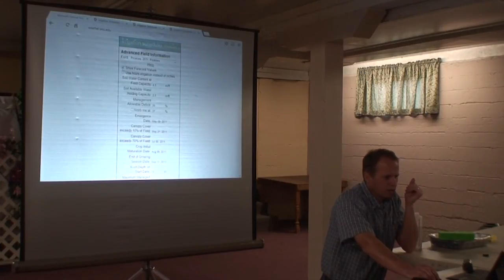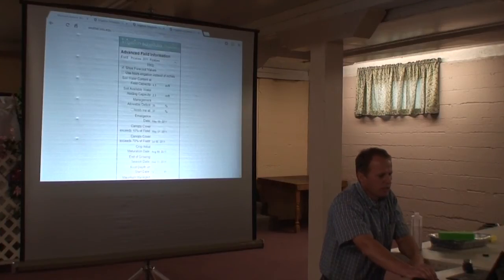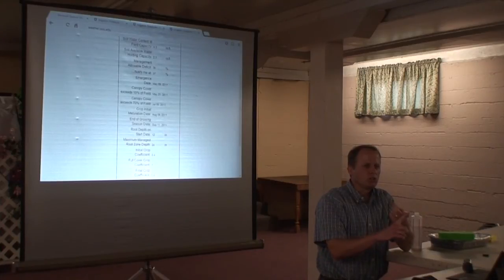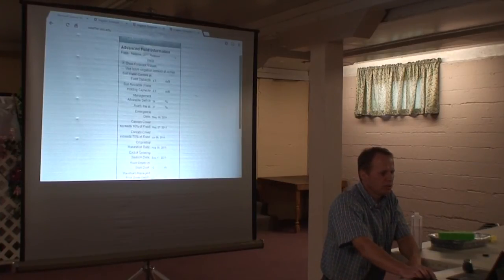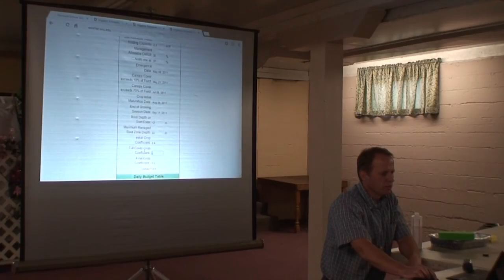I'm in a different field now, and right now it's using inches, but I can use hours instead of inches. But you need to know your application rate. So let's say sprinkle irrigation. It'll help you calculate what your application rate is. It also brings in the defaults for soil water holding capacity based on the crop you chose and the soil texture you chose. And if you know better numbers, then you can put those numbers in and play with those, like these crop coefficients, etc.